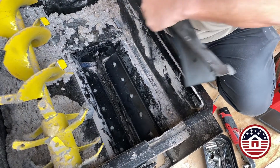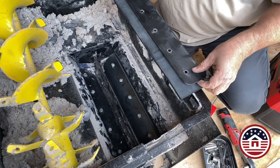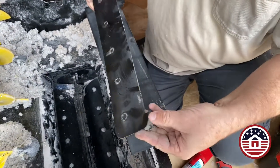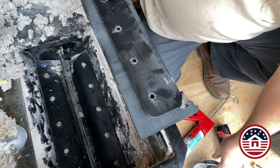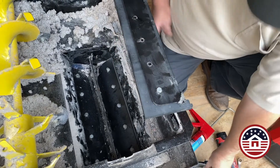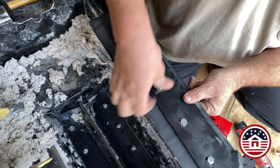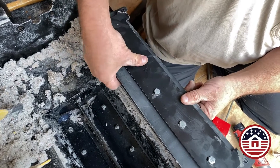Once we remove those bolts, we're going to remove that top plate and place it on top of the new airlock. Notice there is a little curvature at each end of this plate — make sure that it is sticking up and not down into the seal. Then we're going to put all five bolts back into the plate and the new seal. This will help keep it together as a combined unit when placing it back into the machine.